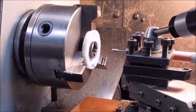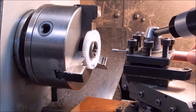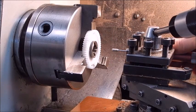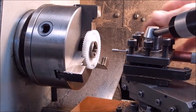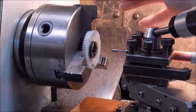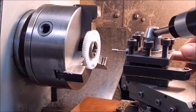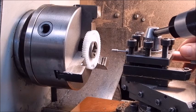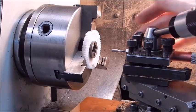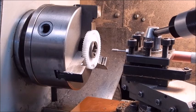I'm going to use the pencil die grinder to cut the four keyways into the gear. Doing it this way, you can index it on the chuck, go in to the depth you want with the little burr, and then finish it off with a hand file. It works quite well — I'll show you.